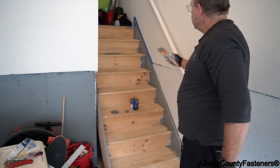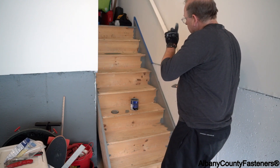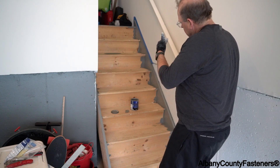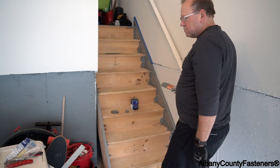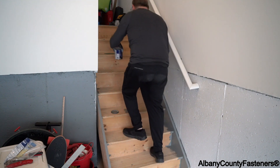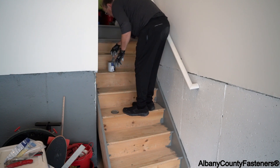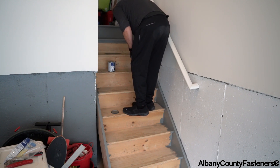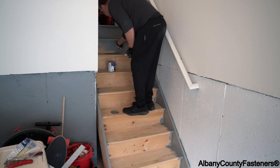My stringers are done. I'm going to go back to the top and work my way down, starting with the top part of the nosing and tread, then down to the risers and treads, and then the first coat will be done and we'll let it dry. Always make sure you get underneath the tread with a nice glob of paint — makes it easier. Even though there are a lot of corners with stairs, they go pretty quick.